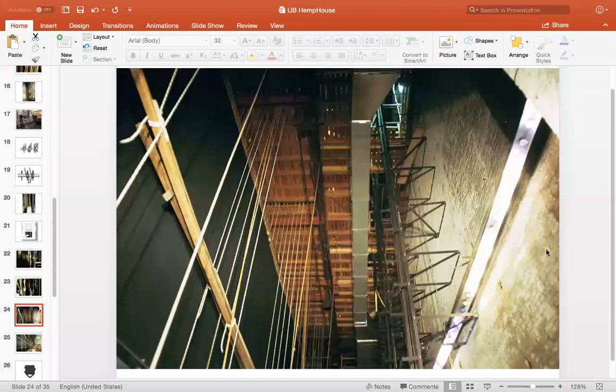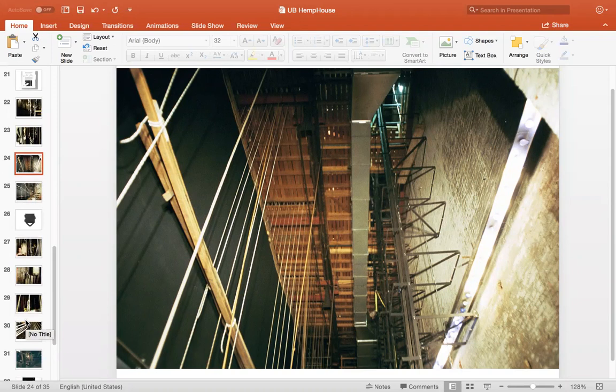In the Geary Theater, we had two paint frames. We had a catwalk, a walkway that walked between stage right and stage left against the upstage wall. There's a paint frame upstage of it and a paint frame downstage of it. And those were controlled by gigantic windlasses in the grid. They're about 6 feet in diameter, had a control rope wrapped around it, and then the lift lines for the paint frames. And the painters would literally attach their drop to the paint frame and then pull those ropes to lift them and lower them while they painted them from the back wall. Yeah.